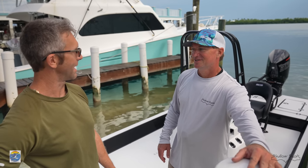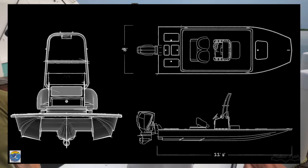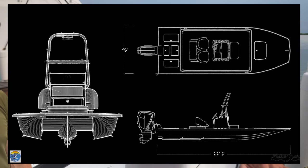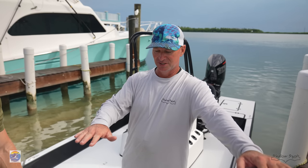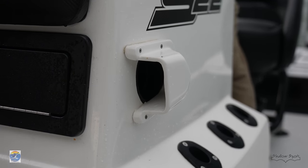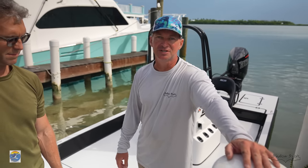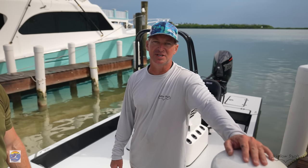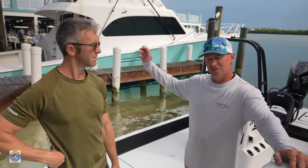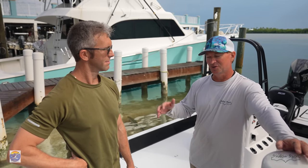So this has a racing-style catamaran hull. It's got a center pod that compresses the air and creates a lot of lift — the faster you go, the more lift it gets and the smoother it rides. If there are bigger waves and the boat launches, it lands softer than you'd expect. It also has a system that scoops air and rams it under the boat through a tunnel, which reduces contact between the boat and the water — making it ride faster and more fuel efficient. It'll keep itself pretty level no matter what direction the chop is coming from.